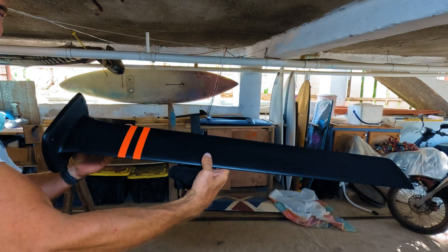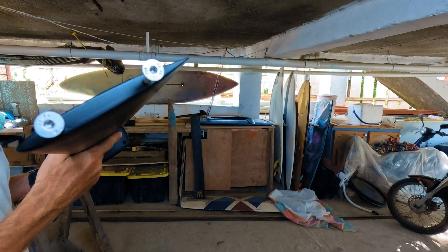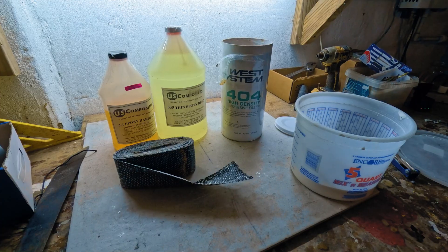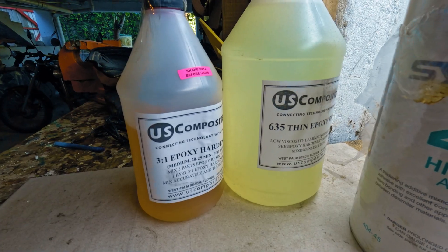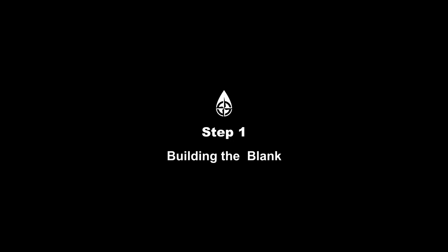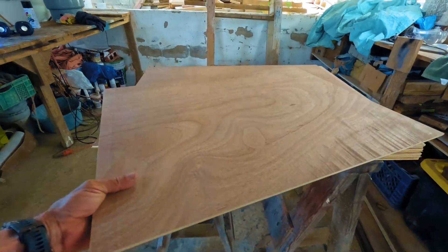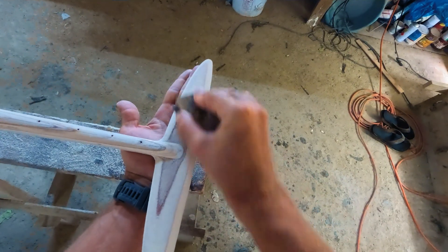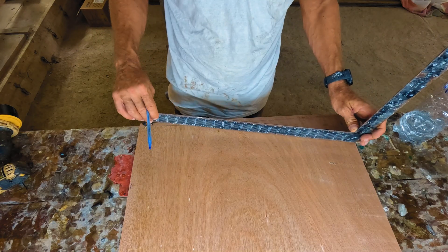For this build, you'll need a mast that you plan to use with the glider. If you want to build your own mast, you can check out my earlier videos where I cover that process. The materials used in this build were 4mm plywood, epoxy, high-density filler, low-density filler, and carbon tape. Plywood is a fantastic material for shaping — it's essentially high-density fiber-reinforced foam, with the bonus of colored layers that help visualize 3D shapes. The best part is that it's cheap and readily available.